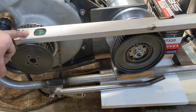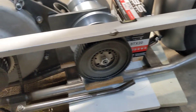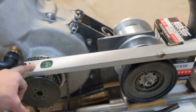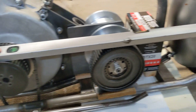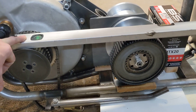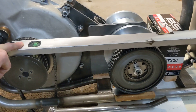This spirit level is 50mm wide, and that means it's the same width as the belt. So you can see from the top run of that spirit level that it is running pretty much parallel to the bottom frame rail, parallel to the ground, and parallel to the plates that hold the gearbox on, which is what I wanted.